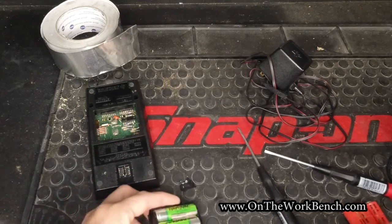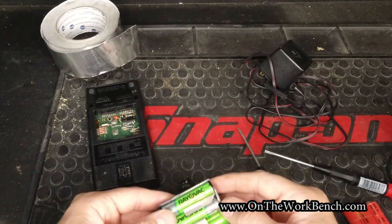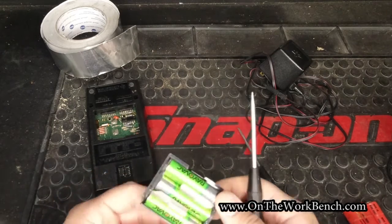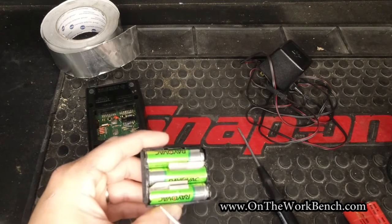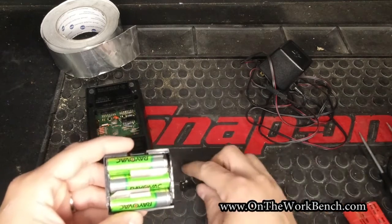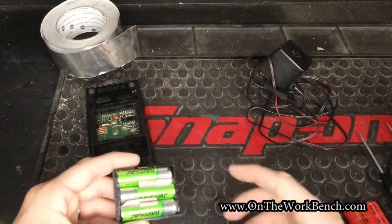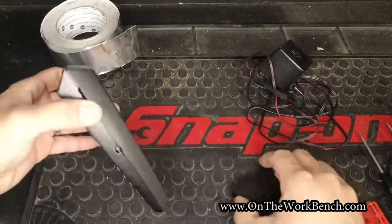Now to get access to the battery, I did have to use a knife to trim off the edges on either side, because there was a little plastic molded piece that was locking these down. Then I used a knife to shear off the terminal connections, and I've just got those taped on here with a little bit of black electrical tape at that end and the other end. If this is the clip side of the pack, we've got the positive side over here, and that's where this top clip is going to. Then the very bottom battery terminal comes off down over here, because if you try to do anything else, after quite a bit of trying, I discovered that it really needs to be something really, really thin, and that metallic tape now makes this basically user replaceable batteries. You can pick up these batteries at Menards or any other home store to find rechargeable batteries.